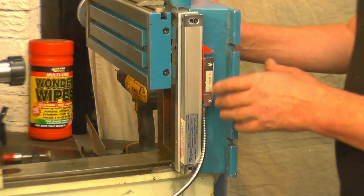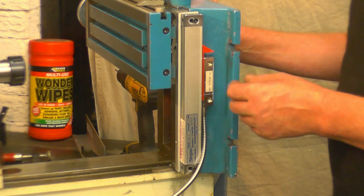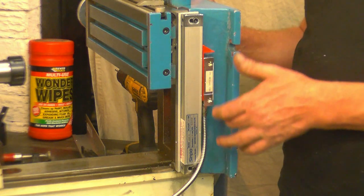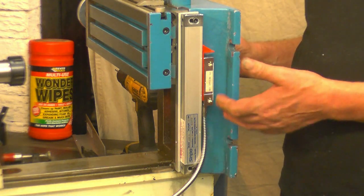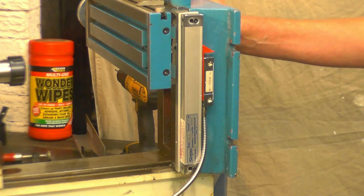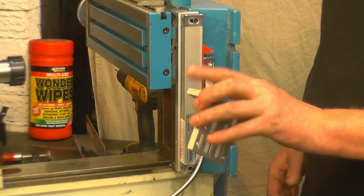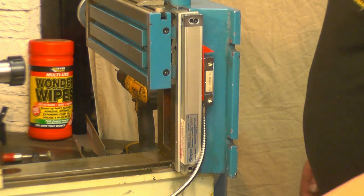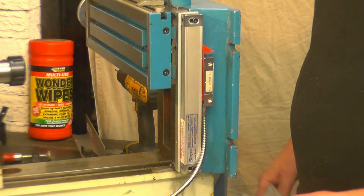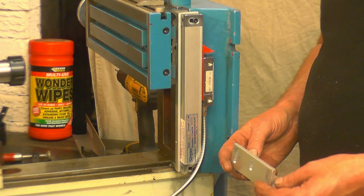That is another way of making a mount that's fully adjustable and very rigid, that you can actually go straight on top of the paint with, because you find if you start taking the paint off, there'll be a lot of filler and all kinds inside the casting. You can see they supply quite a few mounts. These ones are die cast. That's a piece of nice aluminium angle. I think I'll probably end up going with this.